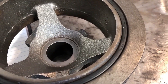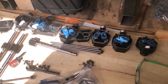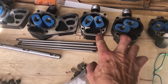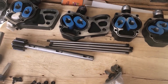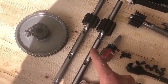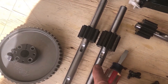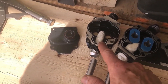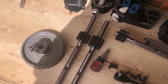I decided to convert my six-stage dry sump pump into a five-stage, because six stages was overkill for the little V6 engine — I didn't need that much suction. Two of the stages are identical, so I'm just going to leave one out. My plan was to shorten the tie bolts as well as the drive shafts for the pump stages. I had a second brand-new set of shafts, but unfortunately the width of the main gears on the main pump are not the same, so rather than buy a whole new housing I'm going to modify the original shaft.